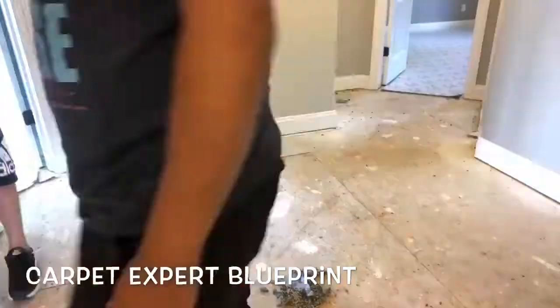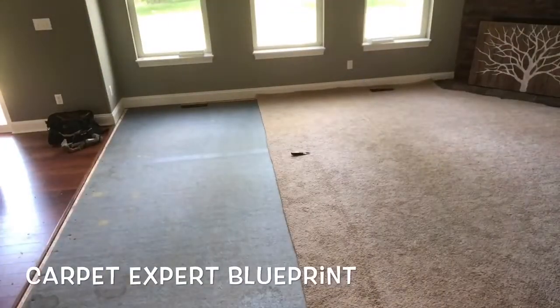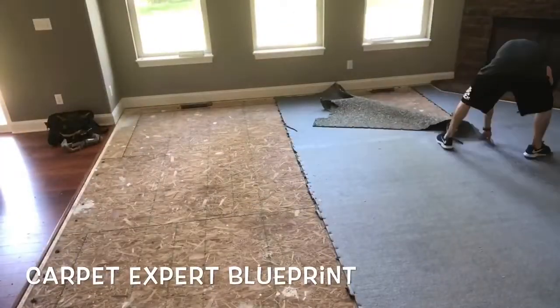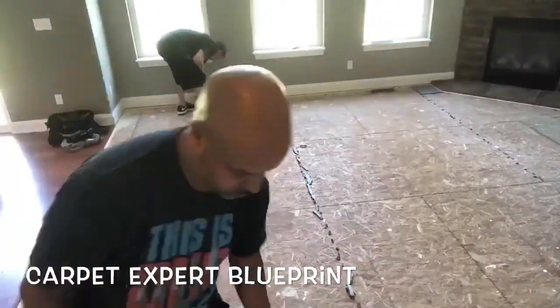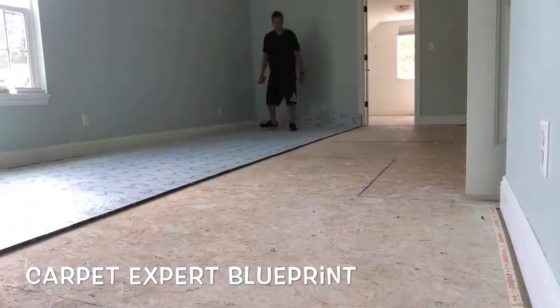In this video we're going to bounce from sweeping that up to jumping into the living room downstairs and dicing up the old carpet down there. Cut it into small manageable sections with your utility blade or carpet knife, then get the carpet out followed by the padding. Roll everything up so it's manageable and easy to carry out, then scrape up all the pad chunks so you get a nice fresh floor to get started on.